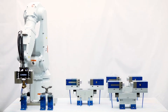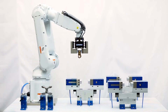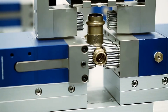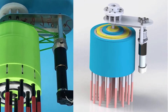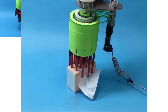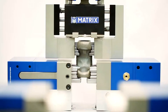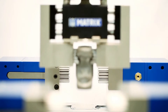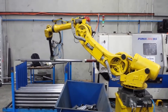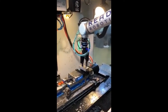Adaptive gripping solutions are some of the most innovative and fascinating mechanical end-of-arm tooling. One solution uses pins to securely grasp objects with widely varying shapes, and a similar design uses a counter-rotating concentric pin array to lock objects into place. While the ingenuity behind these solutions is admirable, many are early in their development and not readily available on the shelves yet. In most applications, great performance can be achieved from simpler and cheaper end-of-arm tooling, such as the simple two-finger gripper.